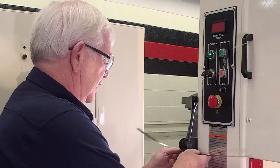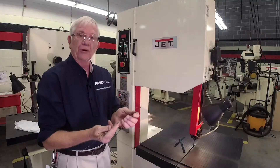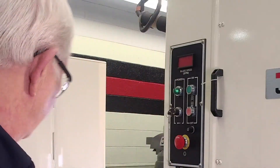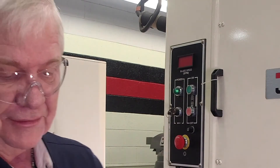We're just going to cut the blade off at a theoretical point, hopefully between the two pieces. This is a critical portion that people often forget — degrease the blade. If you ever try to weld something with a lot of grease on there, you get a bubbly weld. The same thing applies for welding a blade. So I have a little degreaser here, I'm going to spritz that and wipe the grease off so I get a nice clean weld.